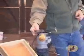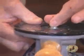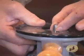Porter Cable, of course, uses their own bushings, and they know what size they are, and so you don't tend to have too much problem with the Porter Cable jigs if you use Porter Cable bushings. Porter Cable, I think, is the de facto standard in the U.S. for guide bushings, and most of the other fancy guide bushings you see are sort of copies of those. This is the system that's been out for about 5 or 10 years from Bosch, which is another system. And Bosch guide bushings seem to be very good. This one is a bayonet mount. We simply drop the guide bushing down in place and release that, and it's now locked in place. And that can ride on the face of the jig.